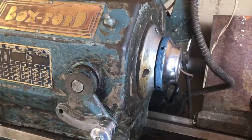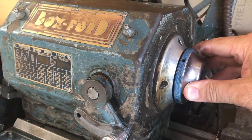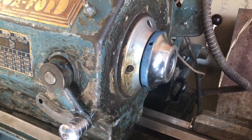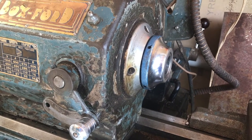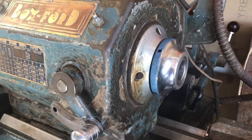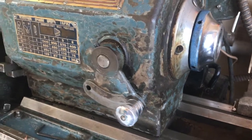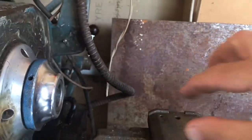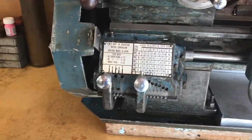The main chuck isn't on here right now. We've got a three-jaw self-centering chuck, a four-jaw chuck for holding asymmetrical objects, and a collet drive for holding very tiny objects very securely in a centred position. You can also do a dog drive — put a centre in each end and hold the piece of work between the two centres. These features will come up later.